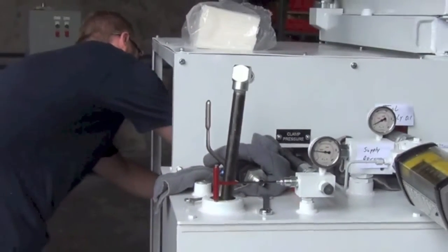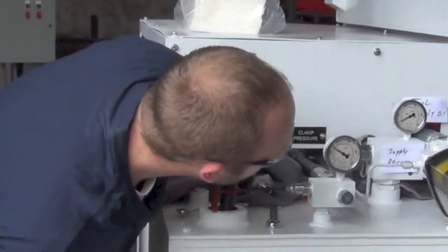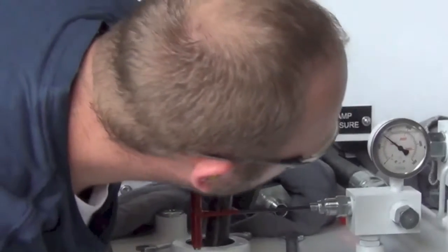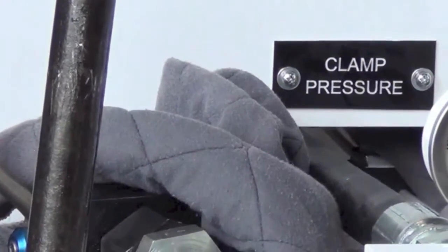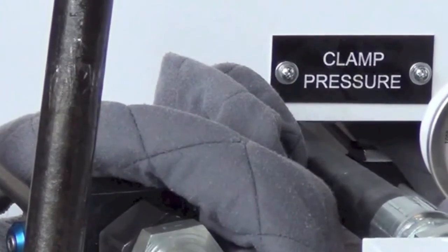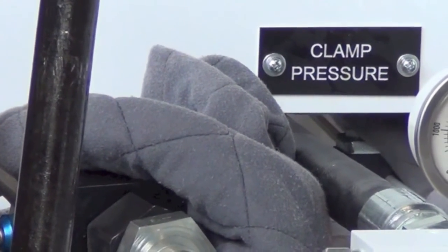At this stage the technician is going to adjust the DR compensator up to the intended pressure setting of the relief valve — in this case he's going to run his compensator up to 1700 psi. The relief valve is run in all the way and is out of the equation. Now that he's at 1700 psi he's going to begin backing that relief valve out until it cracks. He'll know it cracks because the pressure will just barely begin to drop, or if you have a clamp-on amp meter connected to your motor you'll see the amp load start to increase, or in a quiet enough environment you'll actually hear the motor load increase or the relief valve open. Those are all signs that the relief valve is cracked. You don't want to go much further than cracked — just barely back that relief cartridge out until it starts to respond. At that point you lock down the lock nut and the relief valve will be set.